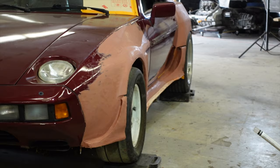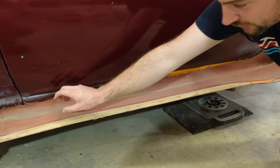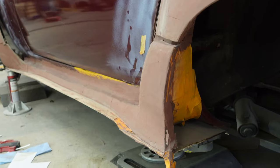I'm going to break this down into pieces we can work with. First, I'm going to take a pattern of this profile, get the length and get the long straight run here. It's one straight piece with no shape, just form. We're going to make that first and then move on to the complex rear intake part of the quarter panel.